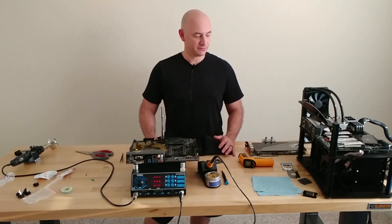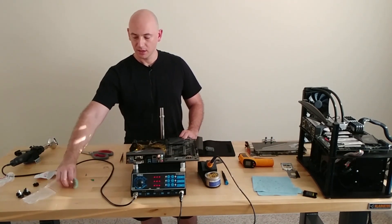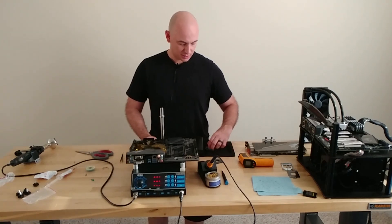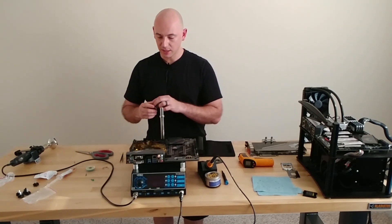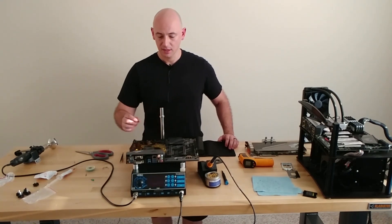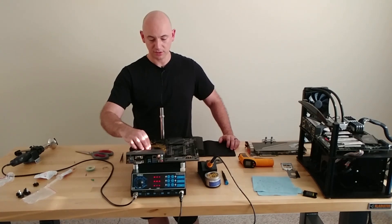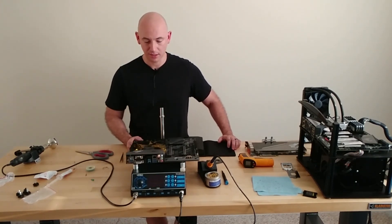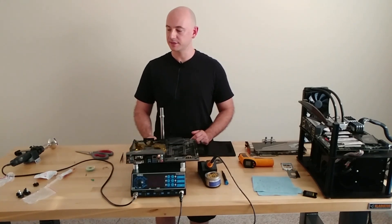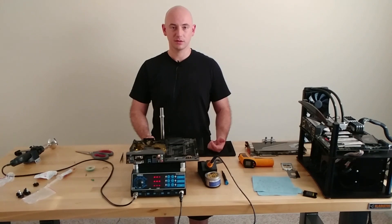Now, the next steps would have been, if I was able to get this completed — once the socket is off and all cleaned up like it is now — using some solder wick and some flux to get all of the remaining solder off of there. If you've got a socket that's re-balled already, it should kind of sit right in place. And once you get it hot enough, the solder should suck into the little sockets and that will hold it in place. You just have to get it pretty much close and it should fall right into where it should go. You can actually kind of feel it if you did a good job getting the solder off the board. Then you heat it back up on the bottom to about 200 degrees, hit it with the heat on the top to about 250, and it should just fall right into place — theoretically.